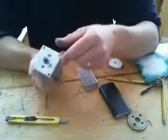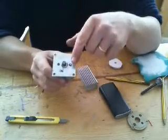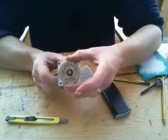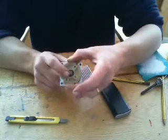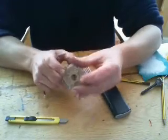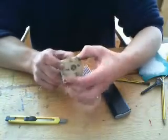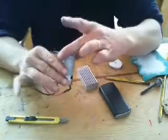So here's my motor with the base plate fixed. I drilled the four holes in, and these two extra holes — how I got those is this is the original plate that held it to the drill. I lined that up with the metal plate by stuffing a 12mm drill bit through the centre hole, which is actually a very tight fit, so it held it quite tightly. And then these two holes here and here were the original fixing holes. So I took a 3mm drill bit and just drilled through those holes, and then I was able to use the original screws to fix the base plate nice and firmly to the motor.